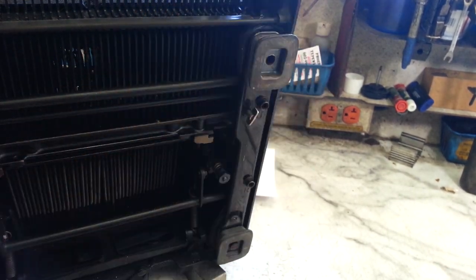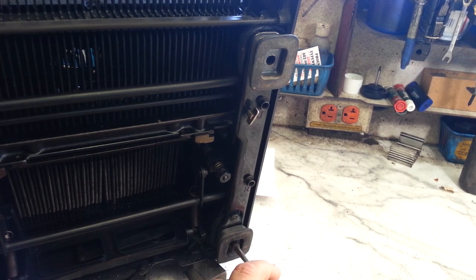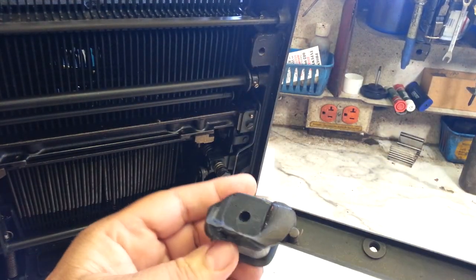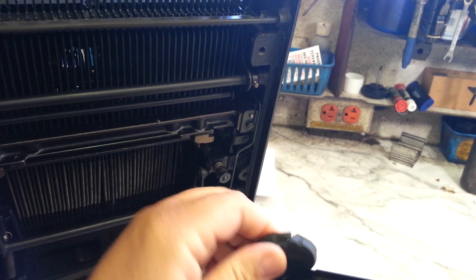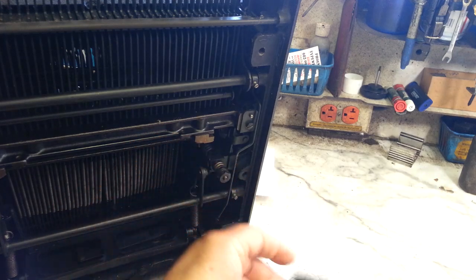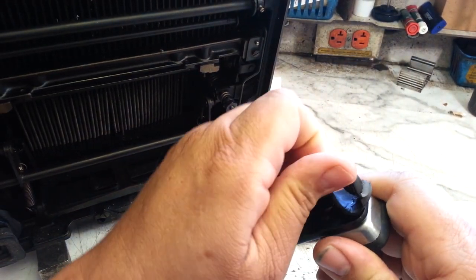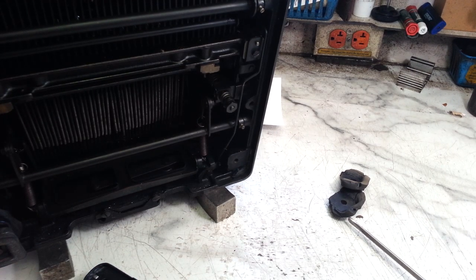It's a pretty easy remedy if you have the spacers. I think I have some new rubber pieces that will fit just right. I ordered them for a Remington typewriter and it turns out they were too big, but I think they'll work in this application. These pieces are just flattened out into nothing — they should be thick like that, but it's all flattened out and squished. Same thing with this one. There are our two pieces and the mounts are pretty simple on here.